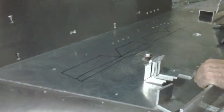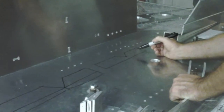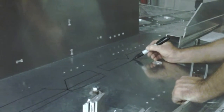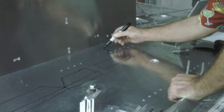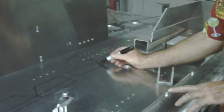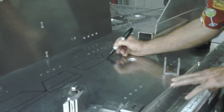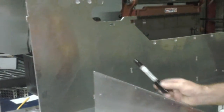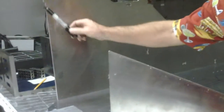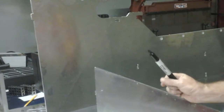and the V doesn't come all the way down, then when you fold this piece around, this is your pivot point, and it does this. Now then, this dimension is a little bit longer than the dimension you wanted it to be, and this dimension is a little bit longer than the dimension you wanted it to be. When you're trying to put tab A into slot B and you have tolerances of 1/1000th of an inch, this fold pushes this slot this way and it pushes it up, and now it doesn't fit the firewall.